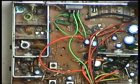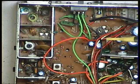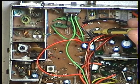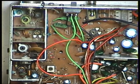We'll set the deviation next. Adjusting SVR3, which is the preset at the back, will bring that to an absolute maximum of 2.5 kHz — which it doesn't need adjusting. That's the only thing which hasn't needed adjusting so far.